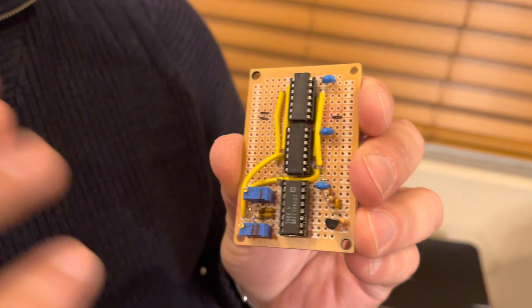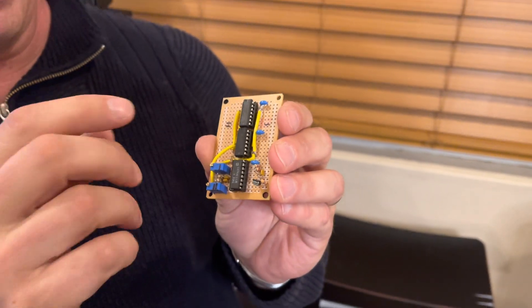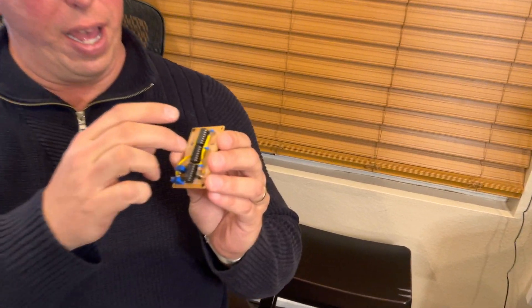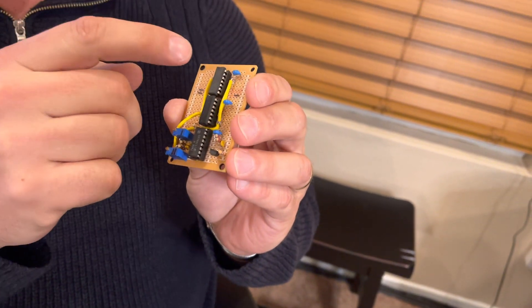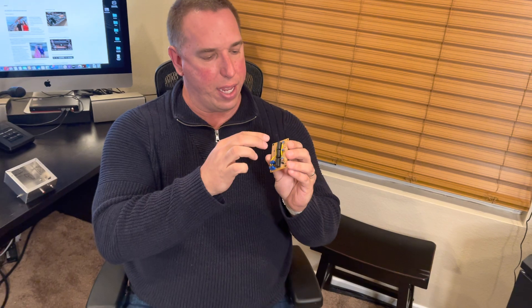This first chip right here is a JK flip-flop. It takes a sine wave from the VFO into the clock input and sends out an output that toggles on the negative-going clock pulse, with two outputs. That then goes to a NAND chip and an isolating chip for the logic to generate square waves at the reduced duty cycle.